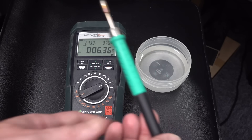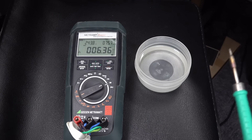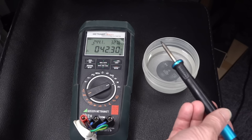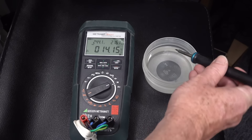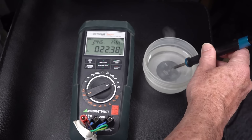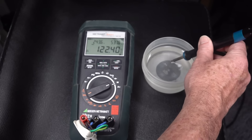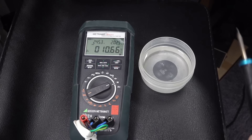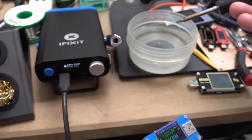For my PACE ADS200 bench iron — 120-watt nominal capability — with just the smallest conical tip I have for it. This thing is available in higher-capacity physically wider tips as I showed in my previous video. Let's put it in. It peaked at 120 watts. It seems to deliver that 120 watts with just the tip. So you can see why I rated the TS11 quite low, and that was the best thermal-capacity tip in their entire range.